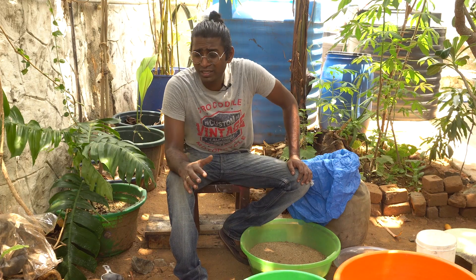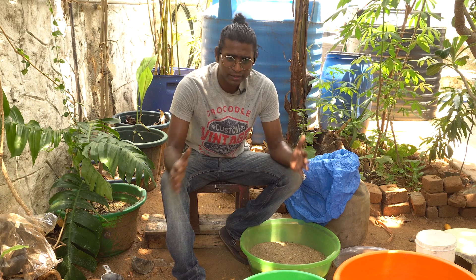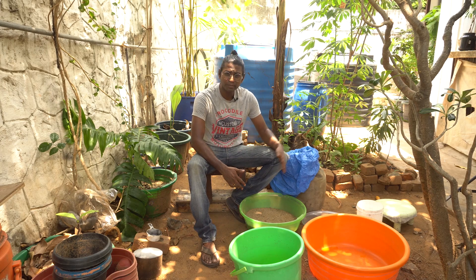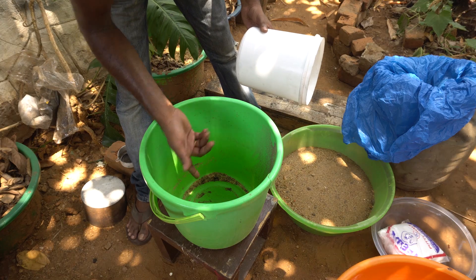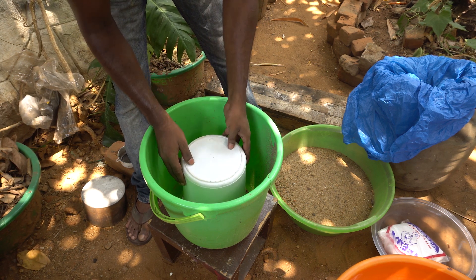The recipe I prepared is inside this cup and I am going to cook it — by cooking I mean it has to be heated to more than 2000 or even 3000 degrees centigrade, for which we need a furnace. I don't have a furnace so I am going to make one. The outside temperature is about 35 degrees centigrade and it is really hot. What I have here is a little bit of construction sand, plaster of Paris, and sawdust from a boxing bag. I am going to mix all of these together and pour them into a mould, making the furnace upside down to flip it later. This hollow chamber is going to be where all the charcoal and flammable material will be placed — the inner chamber.